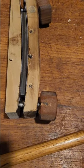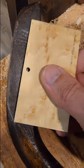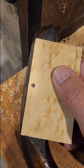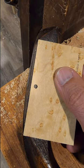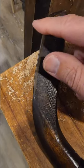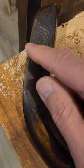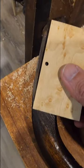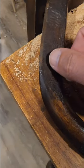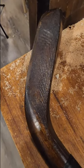Or you could make it flat if you want. In this case, making this club, I needed the horn to be a little curved. You can see there's a little curve to that horn when I compare it to the straight edge — not much, but a little bit. If I used a perfectly flat piece, the horn would be sticking out on the ends too much and wouldn't make good contact. The horn is not very flexible unless it's really thin. So if you ever see a club with a curved or arced horn like this, it tells you it's probably handmade rather than machine made.